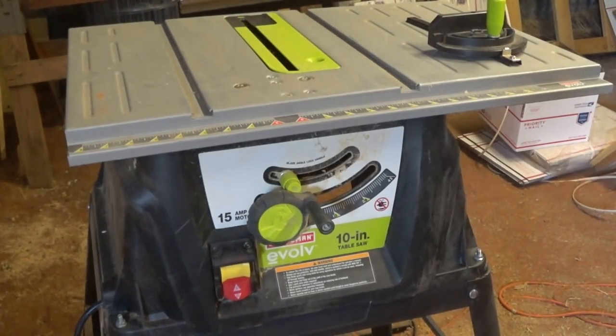This is a 10-inch saw, which is a fairly standard size in table saws, and it can accomplish a good portion of the work for occasional use. If you do a lot of work with a table saw, you may need a professional quality one with a cast iron table, a larger table, or one built in so you can slide larger stock like plywood across it. I've found a much better way to rip and cross cut plywood more accurately than any table saw, which I will discuss in another vlog here on YouTube.